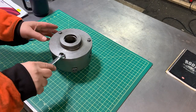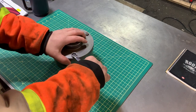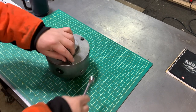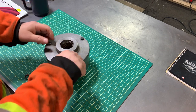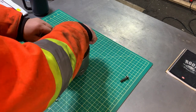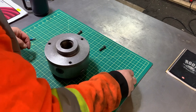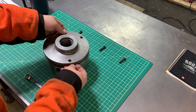Let me show you this recess I was telling you about - this is pretty tight. I've already got it down to two tenths of one thousandths of an inch, but it's okay - I know I can do it again because I've got processes that I follow and it works every single time to bring back the concentricity. Here you can see my back plate.